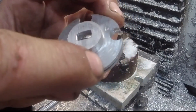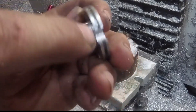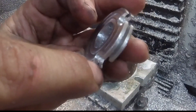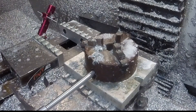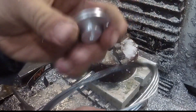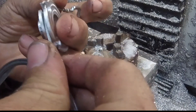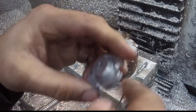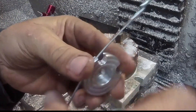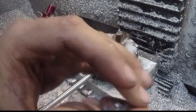That long quarter-inch end mill leaves more chatter than I would like, but it's the only one I've got at the moment. The groove is the right size for a cable. What I don't know is whether this diameter is too small — will this cable take it, or will it constantly try to... I don't know.